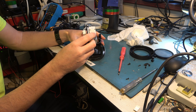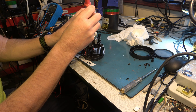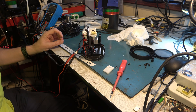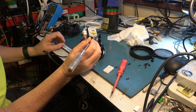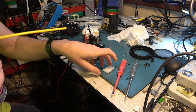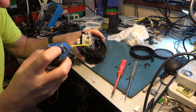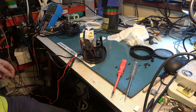We'll take this top off again and have a look to see if the motor is rotating. And if it isn't, it's the motor that's at fault and there's nothing to do with being tripped over. Ah, there — you see it got it going then. So it's a bad motor. I may be able to squirt some switch cleaner into here, but we'll be careful not to get it on the prism there. I don't want this near any of the optics. It's going to be a bit tricky.